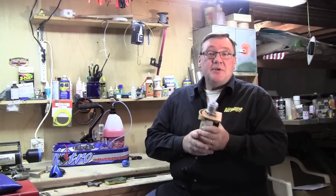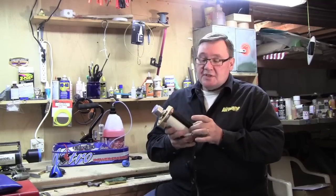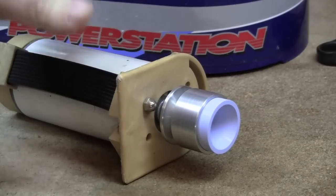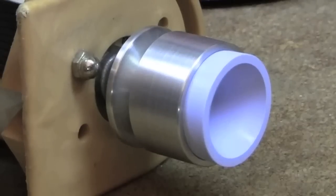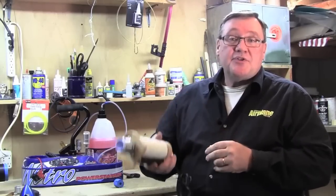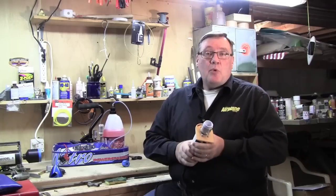As far as maintenance goes, you always want to make sure that the on-off switch inside the rubber boot works properly — you push in and the electric starter starts, and when you let go, it stops. Some things you don't want to do: don't just throw it on the ground when your airplane's ready to fly. Put it back into your field box or engine tote, keep it off the ground, and keep it out of moist grass — it'll all just cause corrosion, and that's never a good thing.